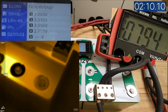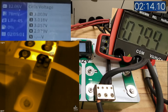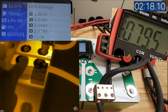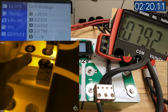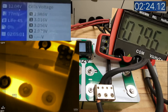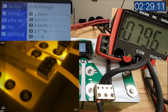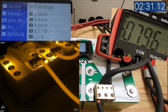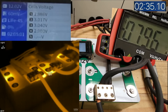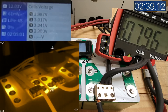The toughest one is going to be this one right here, and then those right there. There are things we can do without adding more copper — like moving that closer to between them, so it has two equal pathways. I might do that in the future, but these ones right here are the ones that concern me. 121°F right now, and we're still around 800 amps. So it looks like this will be able to do consistent load. Let's give it all she's got.